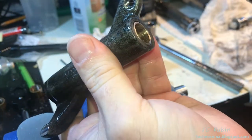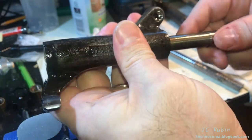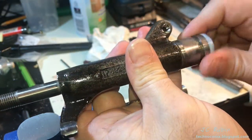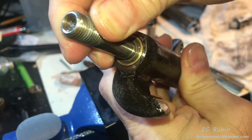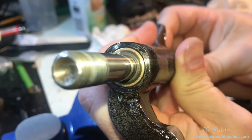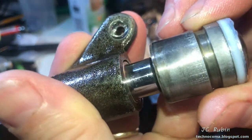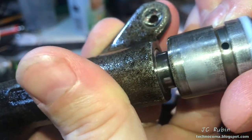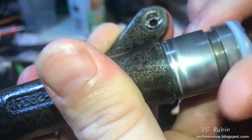Of course, everything has to be scrubbed engine-ready for final fitment, especially after that polishing paste. I took a lot of time to clean this, and putting it all in now we have a really nice fit — no binding at all. Now that we know there's no binding, let's check for deflection. There is no deflection on the top one. Checking the other side we pull back the shaft for a closer inspection — again everything looks good, no deflection, good fit, spins fine, no binding.